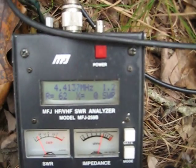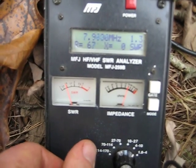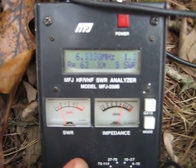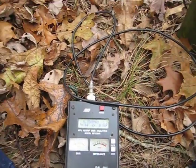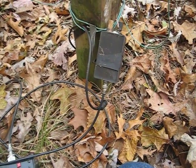Going up to 4 MHz, I'll switch to a higher range and come down from 10 MHz. At 10 MHz it's showing 1.7, and it drops down to 1.5 at about 7.8 MHz, staying that way all the way down. So that's a properly terminated antenna, and provided the feed line into the shack is good, we'll have a good antenna and receive very well with it.